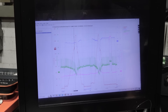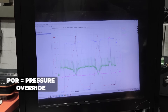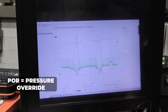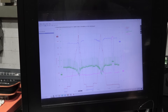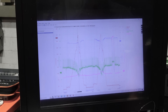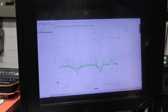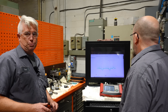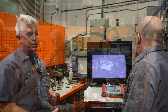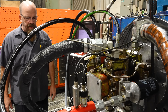At 1,800 RPM we had 23 gallons. I ran it up to pressure — this is where the POR starts to kick in. The POR might be a little low but it works — it only dropped about half a gallon at 3,000 PSI, which is pretty efficient. The customer said that if he could have the pump running at 60% efficiency he'd be happy with that.